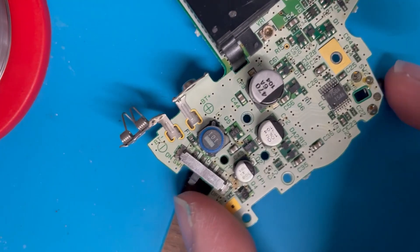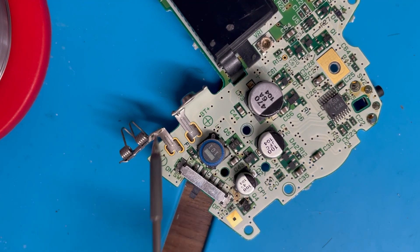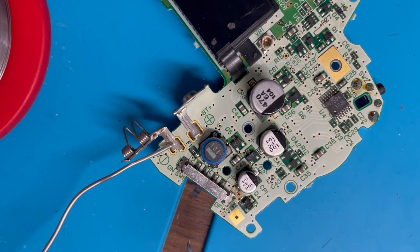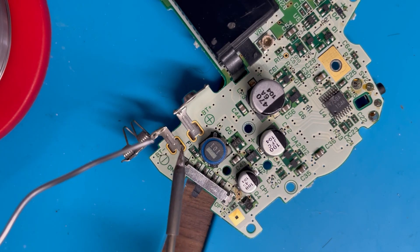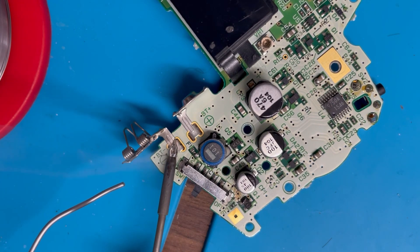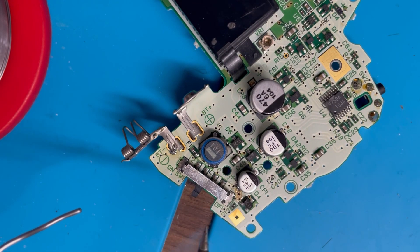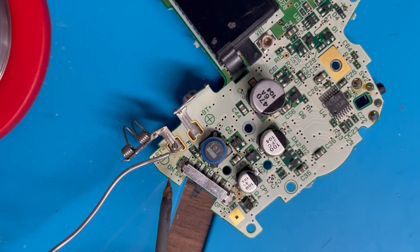The one that people struggle with is the battery spring. The reason is it's a large metal heat sink — a lot of metal — and it's also tinned with likely nickel to prevent corrosion. So before you can solder to big areas like these battery springs, instead of feeding more and more solder in, which just bubbles up onto the end of the iron, all you do is place your iron on the battery spring, feed a little bit of solder in, and then just wait until that solder flows onto the spring. You'll see it disappear off the iron — it's broken through the layer to the metal underneath, and you can now tin it as if you're tinning normal pads, nice and quick.